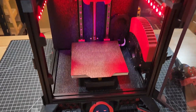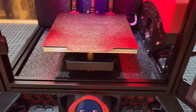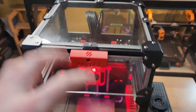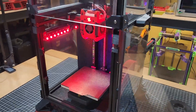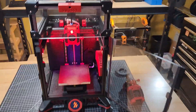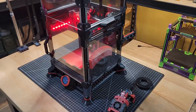The FISEC is an aluminum bed arm. The standard V0.2 has a couple of extrusions and 3D printed parts for the Z-axis build plate, but I really liked the solid one-piece version of the FISEC, so I changed it over to that. I also have more RGB LEDs — I think it's a daylight-on-a-stick style — just for some nice lighting in there. That's most of it for the outside, so I'm going to give this a pause and flip around to give you a better view of the back.